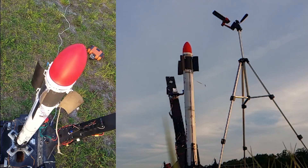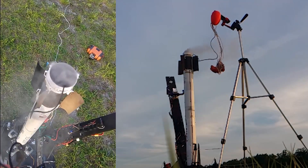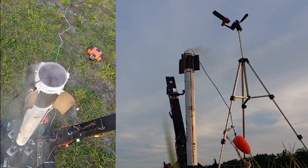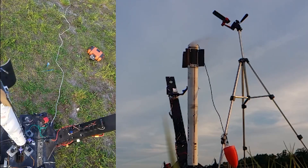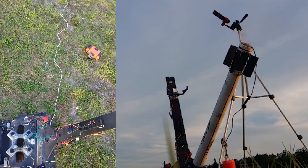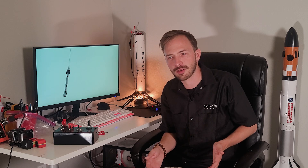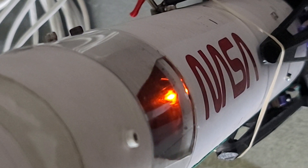The pyrotechnics inside the rocket didn't have enough inhibits to prevent them from going off, so I added a lot of those. Overall I made it so that the rocket can't initiate any of its charges below a certain altitude, but it also has to satisfy all these other conditions before it can do any of those too, to prevent this from ever happening again. Those three safety interfaces all come together to prevent that from happening ever again. We can't change flight mode until we fly, we can't fly until we actually leave the ground, and we can't do any of the other flight modes until we go high enough.